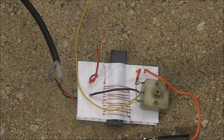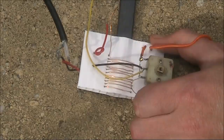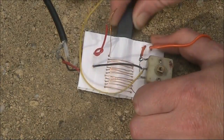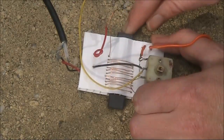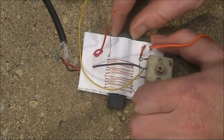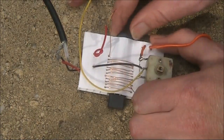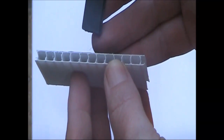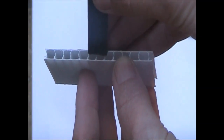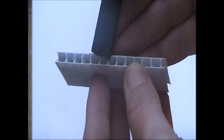The main part of the project is to make the variable inductance. Inductance is lowest when the rod is out, and highest when it's fully in. The type of bar you see here was common in small transistor radios made in the 1960s to the 1980s. I want the ferrite rod to be able to slide into the core flute, so I'll need to cut away two of the separators.